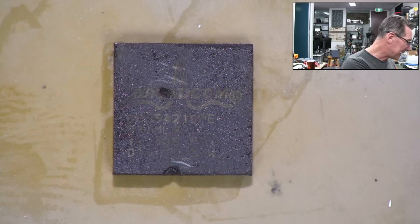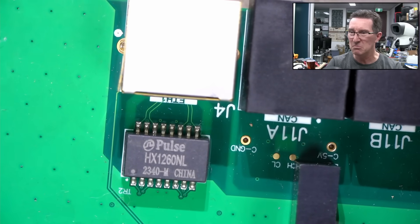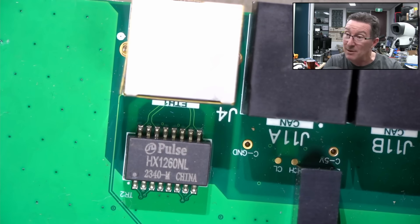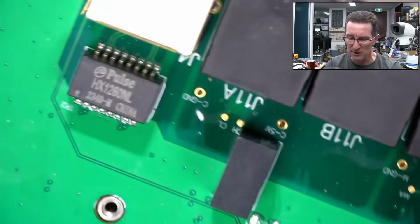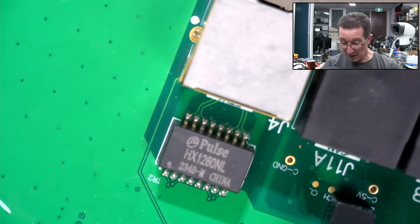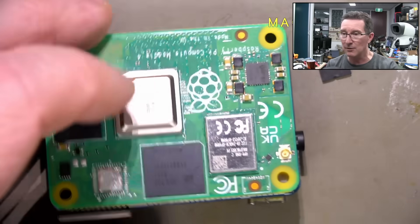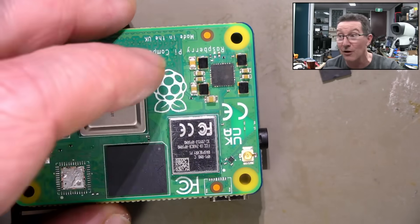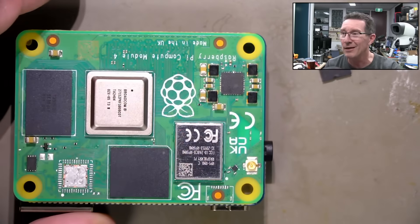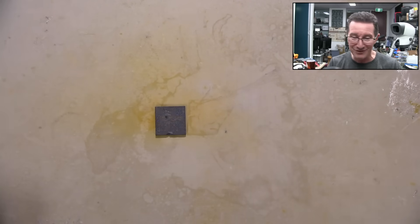Some people wanted to see the bottom of the AERL board as well - Pulse Magnetics, looks fine, no issues there. The Ethernet cable is in the roof going from my router to the garage - nothing to do with this board, it's got the proper magnetics. So I don't know how we got a blowhole in that chip, but the excess current probably took out the DC-to-DC converter, put five volts on the output, and took out everything else. That board is completely kaput. Thank you very much Joe for pointing out that blowhole - my viewers spot everything.